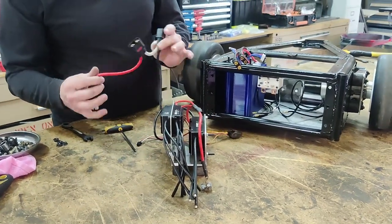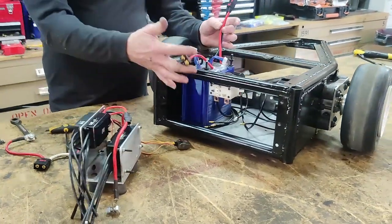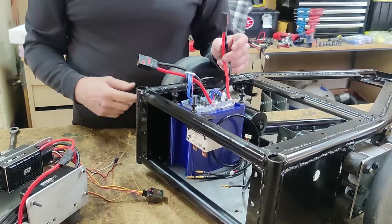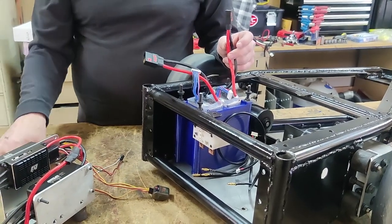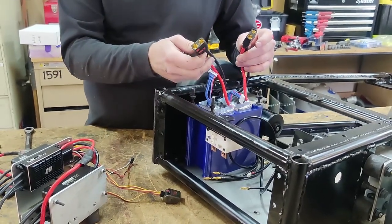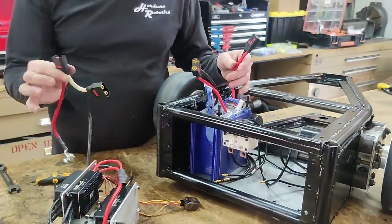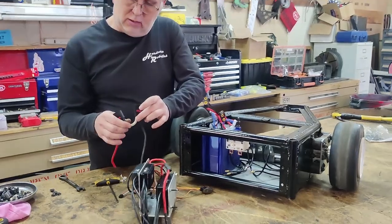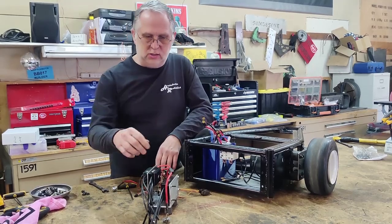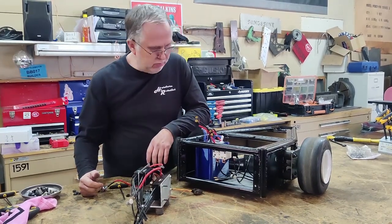These are the main power wires that come off the batteries. The batteries are 6-cell lithium polymer batteries, but I need 12-cell power to the motors I'm going to be using. So these batteries are going to be run in series instead of in parallel — you add them together for 12-cell, and that's why you get this weird little crossover wire between the two. This wire will go to the switch, and this will be power off of the switch to turn everything on.